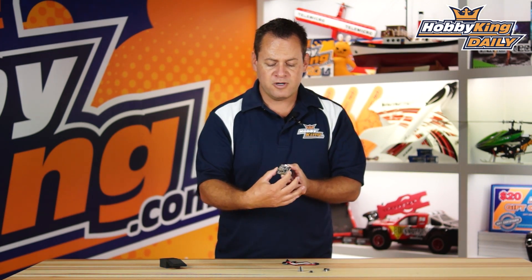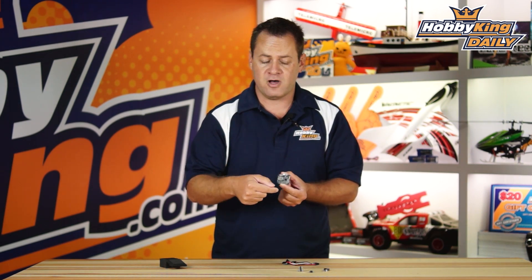This is the Acro version, revision 5 — the latest and greatest. It's a 32-bit ST Micro-based board, and from my personal flying experience this processor is only getting tasked about 10% of its potential, leaving a lot of room for upgrades. It's a newer, smaller footprint — 36mm by 36mm — with 30.5mm square mounting, making it great for smaller quads.